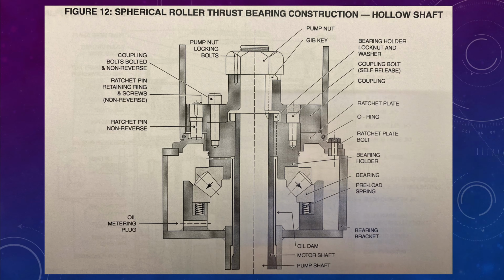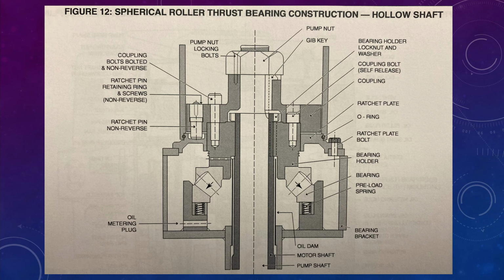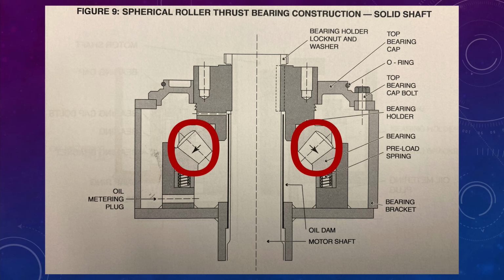So you can check it with the depth gauge from the housing to the top of the bottom end. And that's right over there at the roller where the arrows are in this picture right now. You can see it real well. So right there, that small quarter inch gap to the housing, right to the left, and you can see you can get that measurement. So it'll only be whatever the end play setting is different when you take the second reading. Now at that time, you still have to have the top open to do it.